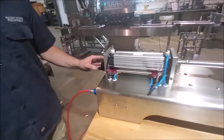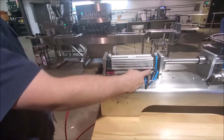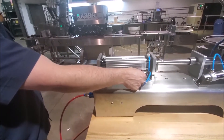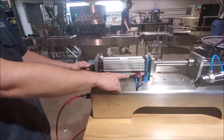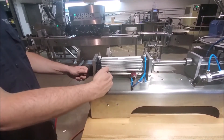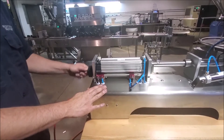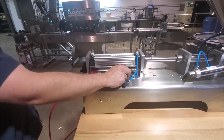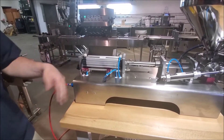Our fill volume adjustment is here on the back. What that's going to do is move this front limit switch forward and backwards. There's a set screw here — it's a 5mm, or you can just hand tighten it, that's probably good enough. As we move this wheel, we can see our front limit switch moving forward. The further this way is less fill; the further towards the front of the machine is a greater fill. Once you get it set, I always like to tighten it up a little bit — finger tight is probably pretty good, you just don't want that thing moving.